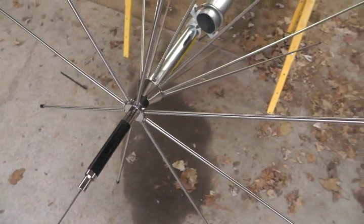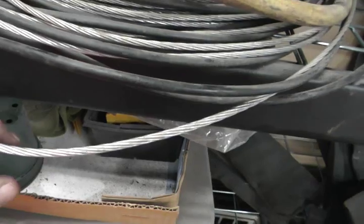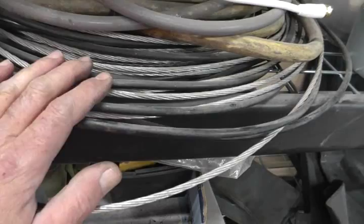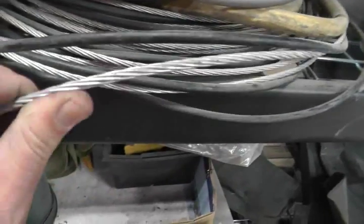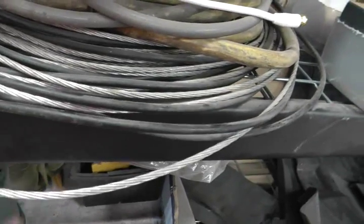Now I'm ready to carry this over to the side of the house and up the ladder and stick it in place. It's going to be important to ground that mast, and after I raise it up there and bolt everything together, I'm going to attach this ground wire. I have this piece of service cable ground — if that's what I have, that's what I'm going to use.